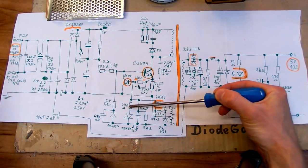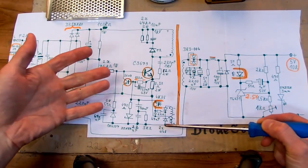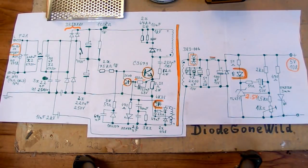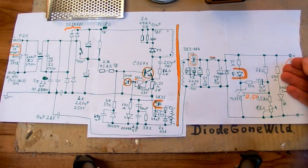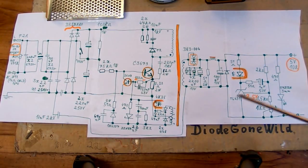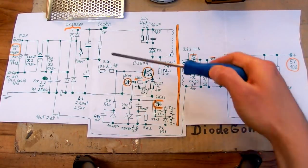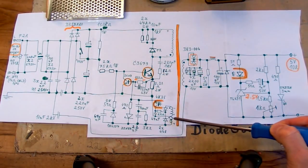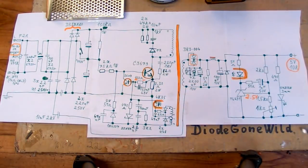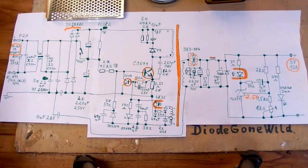Now the question is, what did this Zener and this resistor do? It looks like some overvoltage protection, which kind of shuts it down or reduces the duty cycle in some kind of overvoltage. But is it the overvoltage at the input or overvoltage at the output? Which is basically an open loop protection. But given that it senses the voltage on this winding when it's in forward, it kind of senses the input voltage, because the forward voltage on the windings basically depends on the input voltage. So it looks like this is kind of limiting it when there is overvoltage.